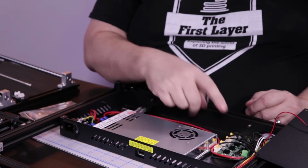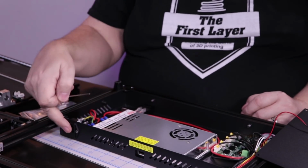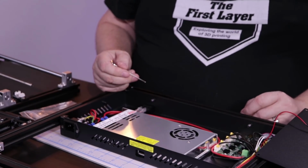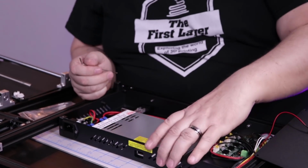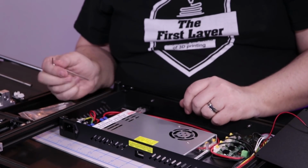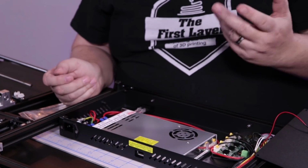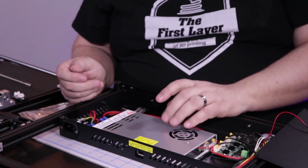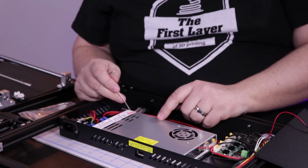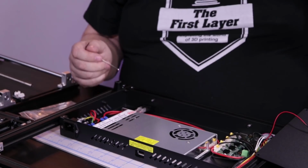Would I recommend that you change out this board? Probably at some point. This does not have a MOSFET inside the box. So I guess it's going to be to each his own on this. But two things concern me about this: one, the gobs of glue like they always do. Not having a MOSFET would probably be a primary concern for me, as well as the Landy power supply, which looks to me as if it's a Meanwell knockoff.